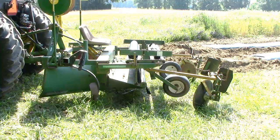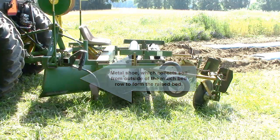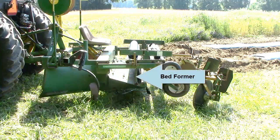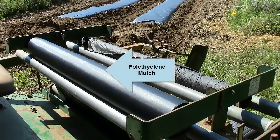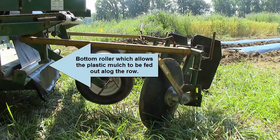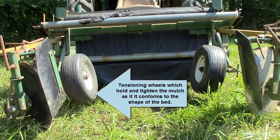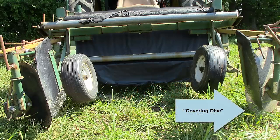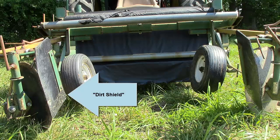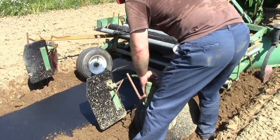The first component of a mulched bed layer is the metal shoes, which pull soil from outside of the row into the bed former. The bed former shapes the soil into a firm bed, preferably with a slight crown in the middle. The polyethylene plastic comes in rolls and is placed on rolling carriers. The plastic is fed down to the bed former and under a roller. Tensioning wheels hold the plastic as it conforms to the shape of the bed. Cover discs throw soil over the edge of the plastic to hold it in place. The dirt shields control the amount of soil left on the edge of the bed. Adjustments of the cover disc and tensioning wheel are critical for proper operation.